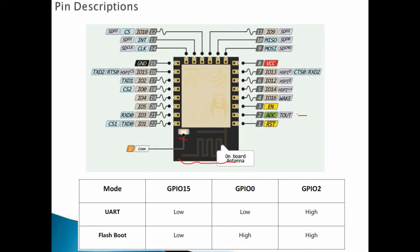So we can see here we've got the ADC pins, we've got the PWM here. You can see this sign, it represents the PWM functionality, and we've also got the RX and TX, which we will use for communication with another serial or UART device. And we've also got the MISO, MOSI, these are the SPI, and the rest of the interfaces.